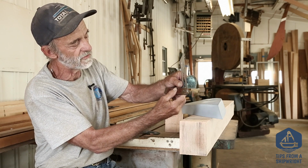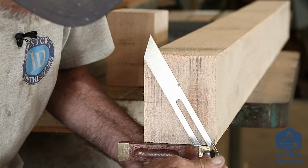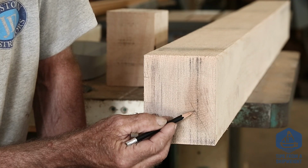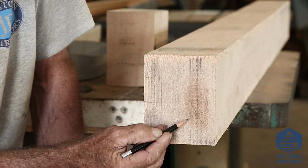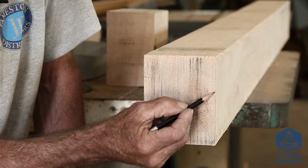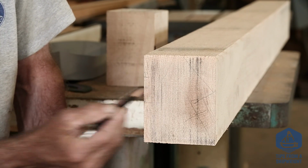And what we're going to do now is set the table saw and rip that dimension on the end of this piece of material. And I'm going to draw you a little line. It's going to be sawn in from the very corner of the stem right there, like that. Now that cut right there is the cut that accepts the planking. The planking will enter into the stem right in here and be fastened into the stem like this. So then I'm going to make another incision, and it's going to just cut that piece out of the way. So that's the second set, and then I have to set the table saw again to cut the material off and leave the cut water at the end.